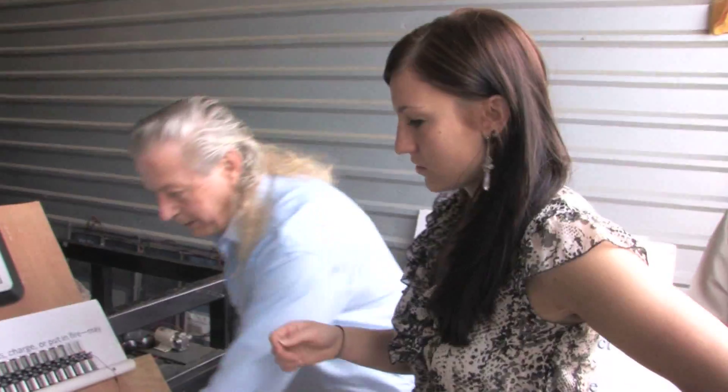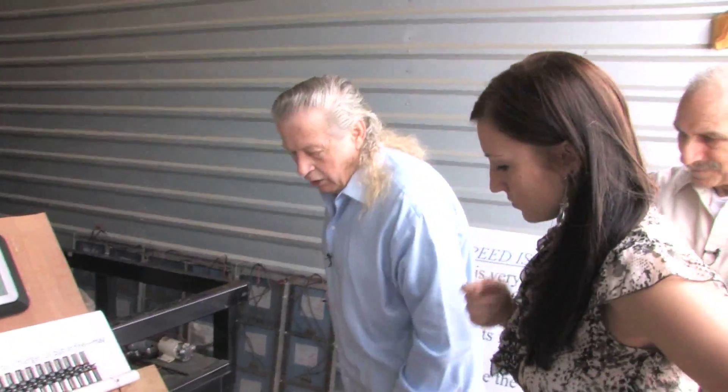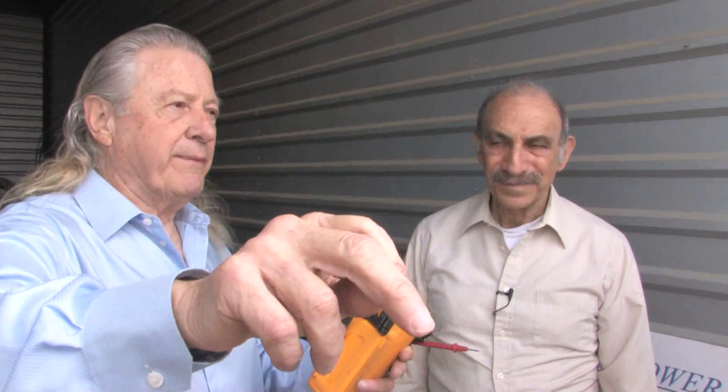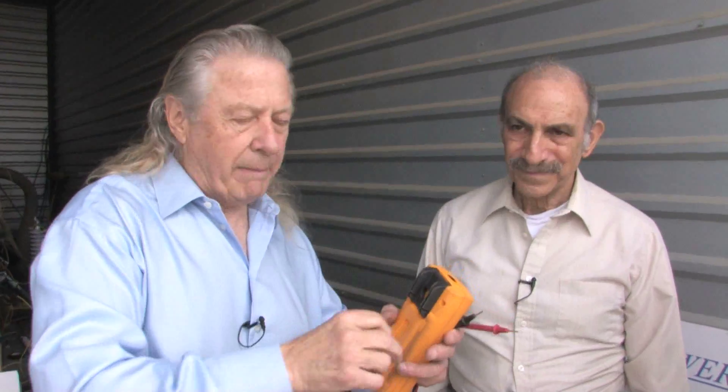Now I'm going to show you something else. There's a law called Kirchhoff's Law. The second law says that if you have loads in a system, you'll have a voltage drop across each one of them. But if you add up all the voltage drops across the system, it will equal the input voltage. The equation states that the difference between the input voltage and the voltage drop across the system is zero — meaning there can't be a difference. That second law is used to verify the conservation of energy.